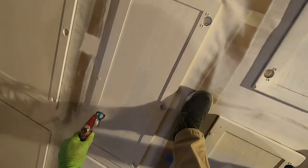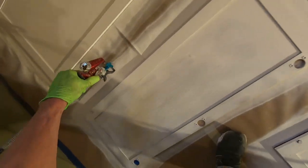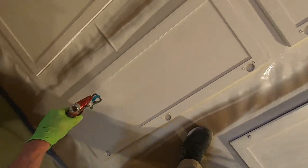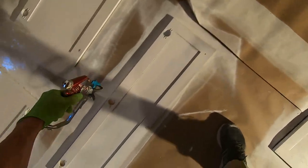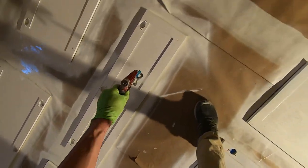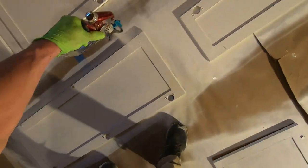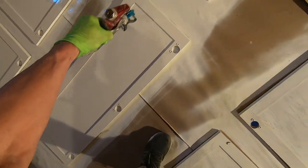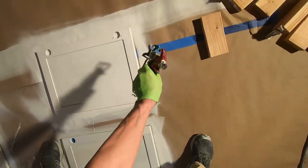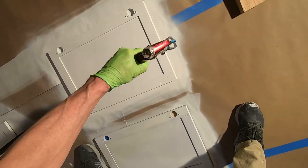Anytime you take to set up, it's a wash in your overall time. It's worth the time to set up because it's going to save you time, but it's also going to give you a perfect factory look and finish. This cabinet coat is a nice hard acrylic enamel. We might use the Advance from Benjamin Moore, or we might use Command. The one thing about Command — it dries pretty quick. So unless you're spraying, I'm going to use either cabinet coat or Advance for manual application, like if we were rolling and brushing.